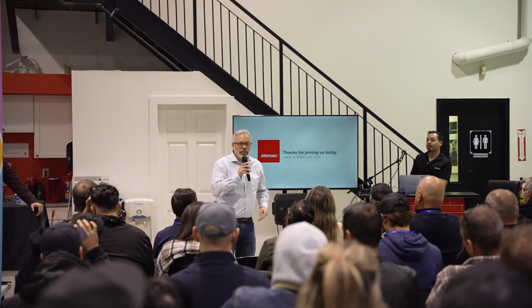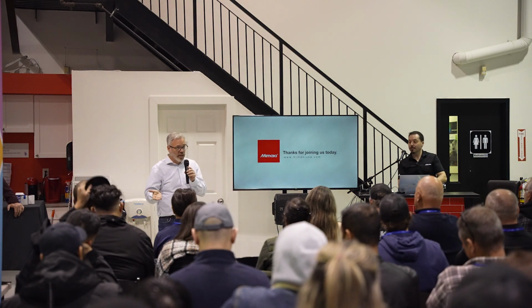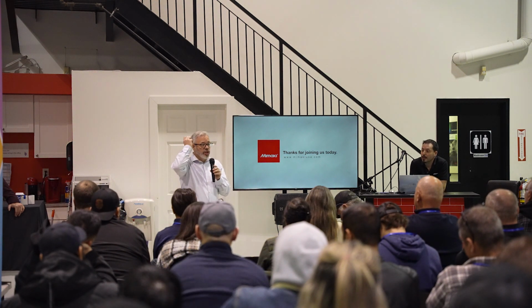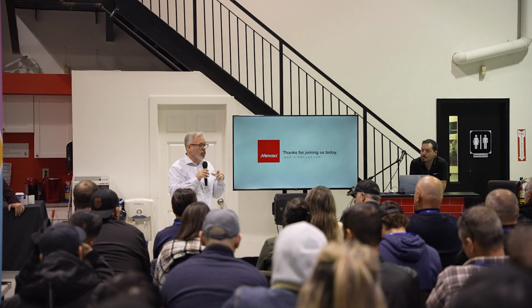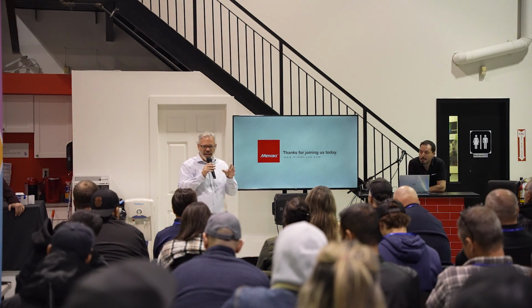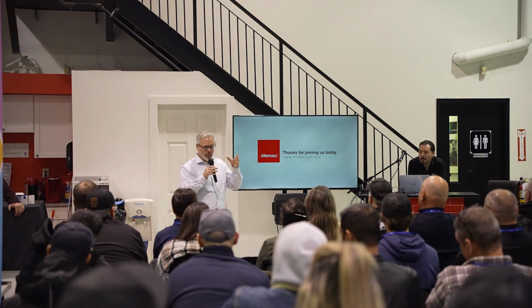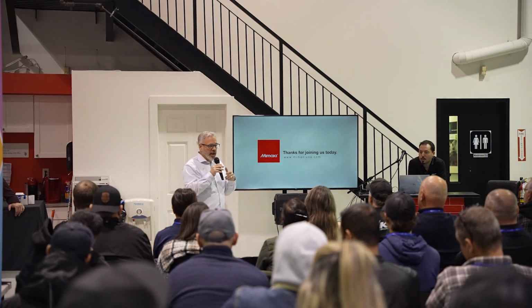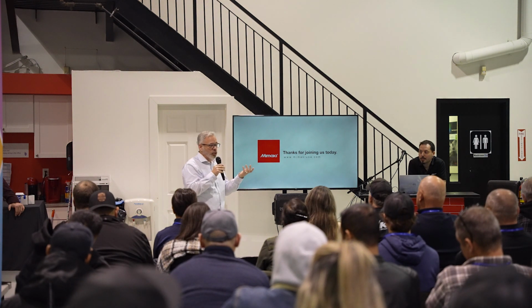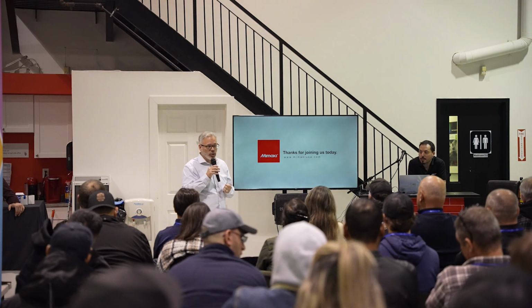Yeah, so hopefully everyone heard the question, but it was essentially how often do we need to shake the white ink? That was the first part of the question, and I think the second part was, do we need to shake the cartridges for the other colors? I would preface this answer by first saying the word shake is kind of a bad word. We don't really want to shake the ink cartridge. Really what you want to do is just rock it gently back and forth. As we mentioned earlier, if you actually physically shake that thing like it's a pepper shaker or something, you run the risk of introducing bubbles into the ink, which we don't want to do.